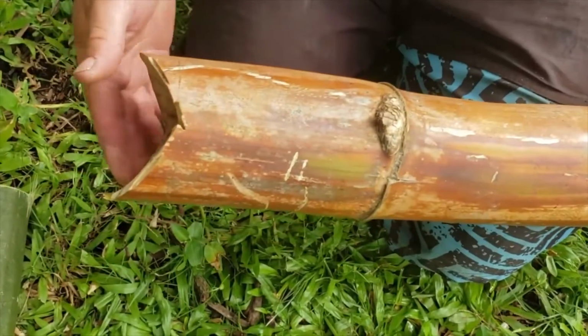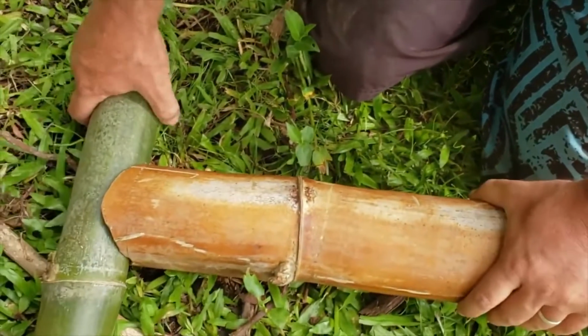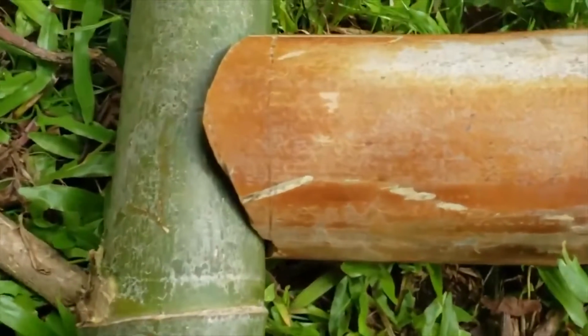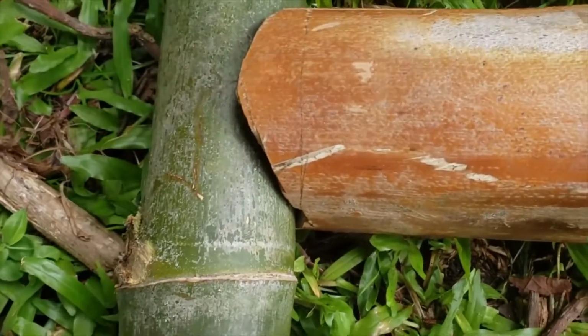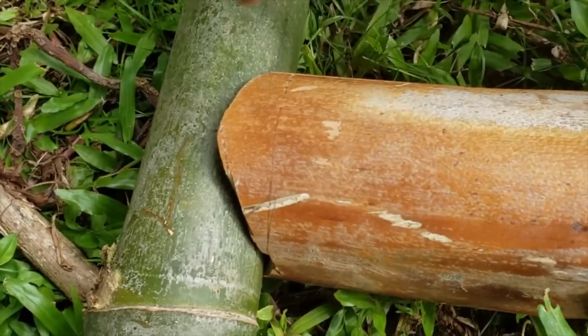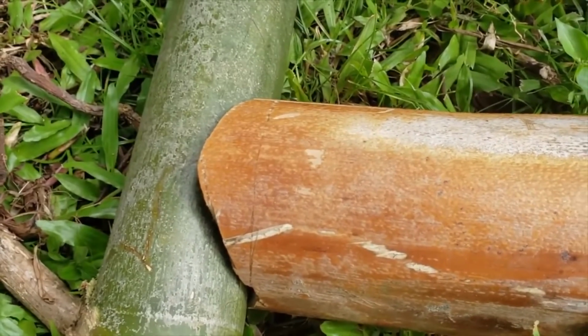So you can go ahead and take this fish mouth joint and put it right up to your horizontal bamboo piece here. See how well it fits. This piece is fitting in pretty well. They're both pretty different in size. And then you could go ahead and secure that with a dowel, but right now I want to show you a modified version that'll make this joint even stronger.